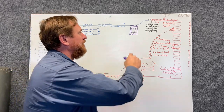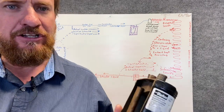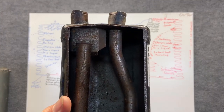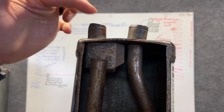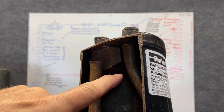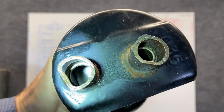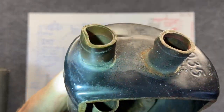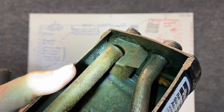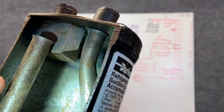So the next thing — let's talk about why is this tube coming down into the bottom. Let's take a look at what that looks like better than my drawing. Here's our suction line accumulator. This is the in port and this is the out port. If we look at the in port, it doesn't really go anywhere — it just comes out of the side and allows the refrigerant to fall straight down into the bottom.